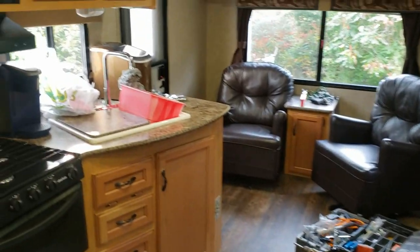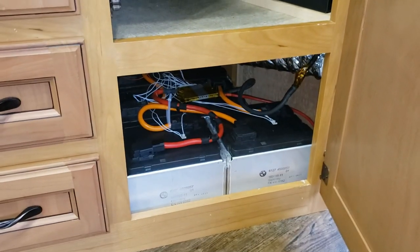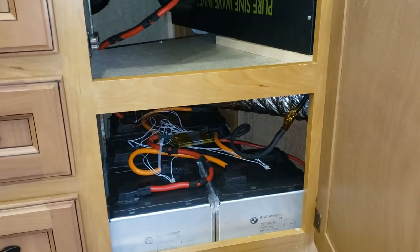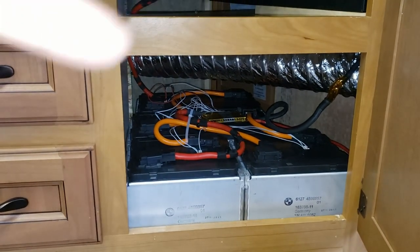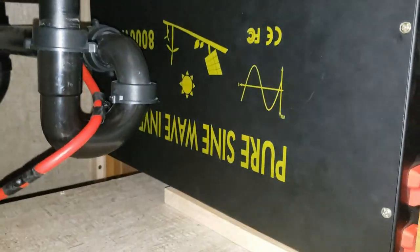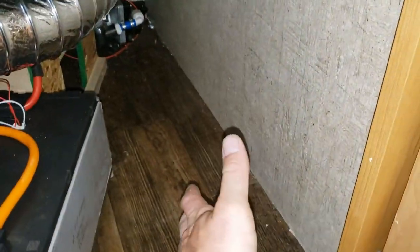Now here's the kitchen — this is where I decided to put all the solar, batteries, and inverter for now. The BMS wires are all over for now, I'll zip tie and tidy that up. This is only half the batteries I'm going to put in here: 90 amp hours, 66 volts full charge, nominal about 60 volts. The 8,000 watt inverter is in here, and I'll access it and do all the wiring from this side.